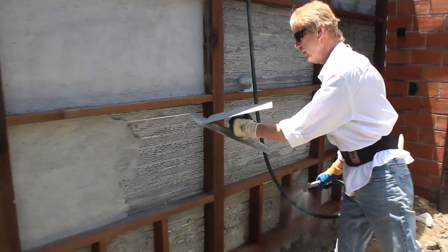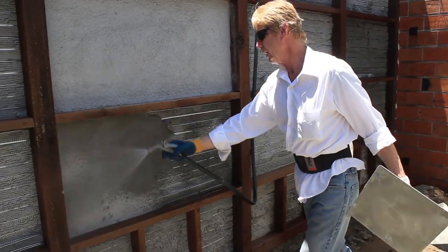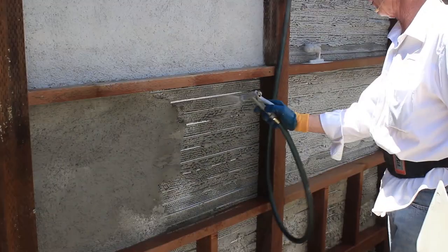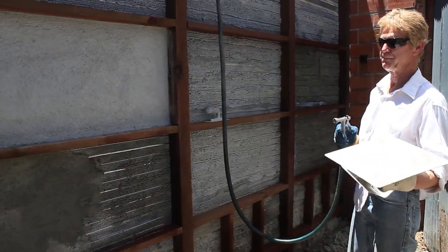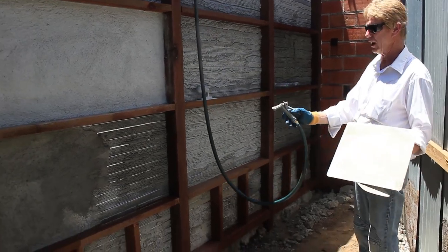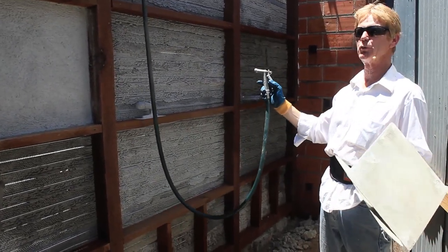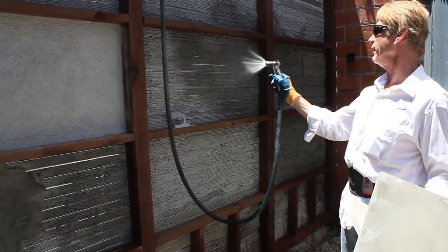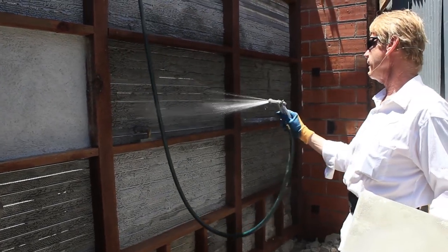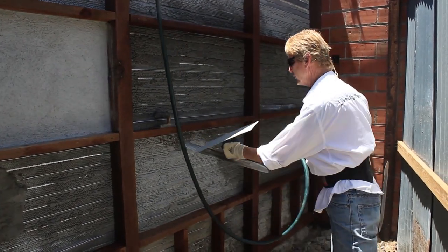You hydrate it. And for this wall right here, I'm going to finish this to prove a point. I just want to wet it a little bit so that the stucco won't adhere and suck in too fast. If it sucks in too fast, then I can't put my base, I can't put my follow-up coat. Hydrate means when you do the scratch coat, you hydrate. When you do the brown coat, you hydrate. You just soak it. Say it just got stuccoed, you hydrate it and let the water just come down and soak into it.